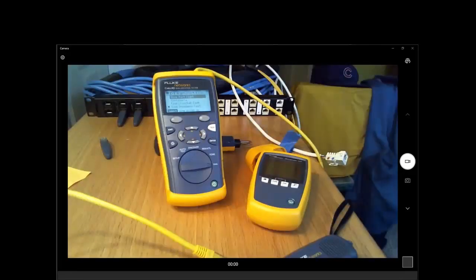We have had a couple of cases where we found cables that would even pass category 6. But when we did a TCL test to measure the balance, the cable wasn't well balanced and it wasn't able to come up with gigabit speeds. But those start to get into some corner cases and some tricky situations. First, I would check and make sure you've got both ends set to auto negotiate. That's a really good point.